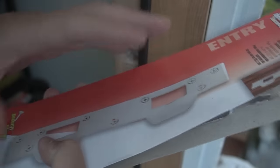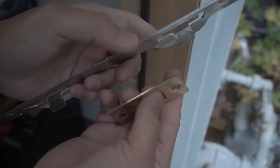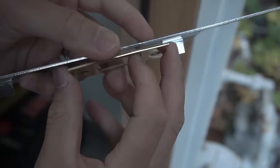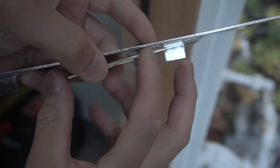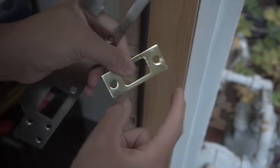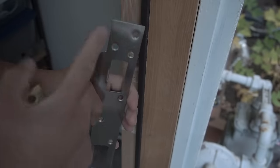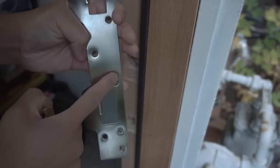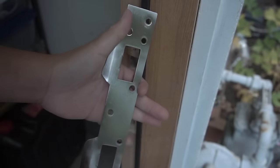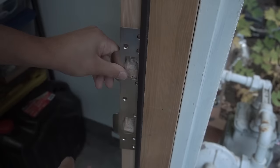So with these two strikes taken out, I'm going to introduce to you this plate right here. I'm in no way sponsored by any of these products — I just want to show you what I'm doing to protect my door from getting kicked in. This door strike is a little thicker compared to the ones we're replacing. Look how much thicker this is compared to the old door strike. And what's great about this is instead of being secured onto two points — in this case four points total — this has multiple contact points. You've got nine points of contact onto where your door jamb is going to be.